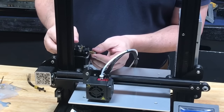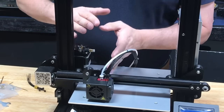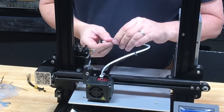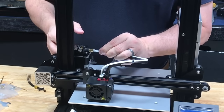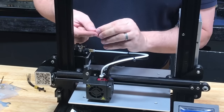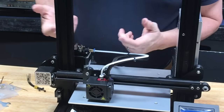There's also a coupling that screws into the extruder at the back — just hand tighten that because you'll take it on and off all the time when loading filament. Then take the PTFE tube, stick it in until it bottoms out, take a smaller blue clip, put it on that coupling, and lock it in place.